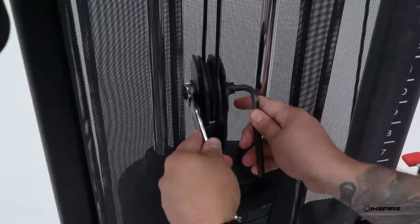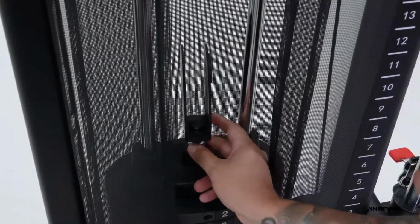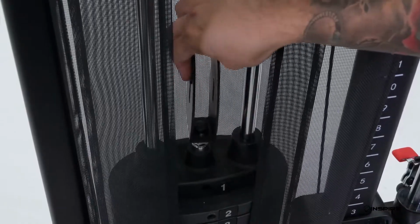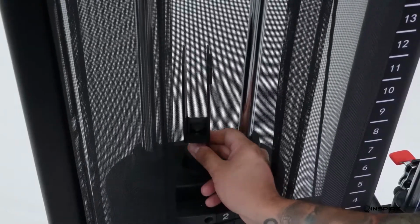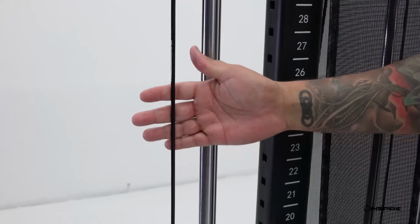First, remove the pulley from the top plate assembly. Now loosen the lock nut below the pulley bracket. Now, if your tension was too tight, you will need to unscrew the top bracket by rotating it counterclockwise. Then tighten the lock nut completely. Reattach the pulley with the cable and check your tension again.